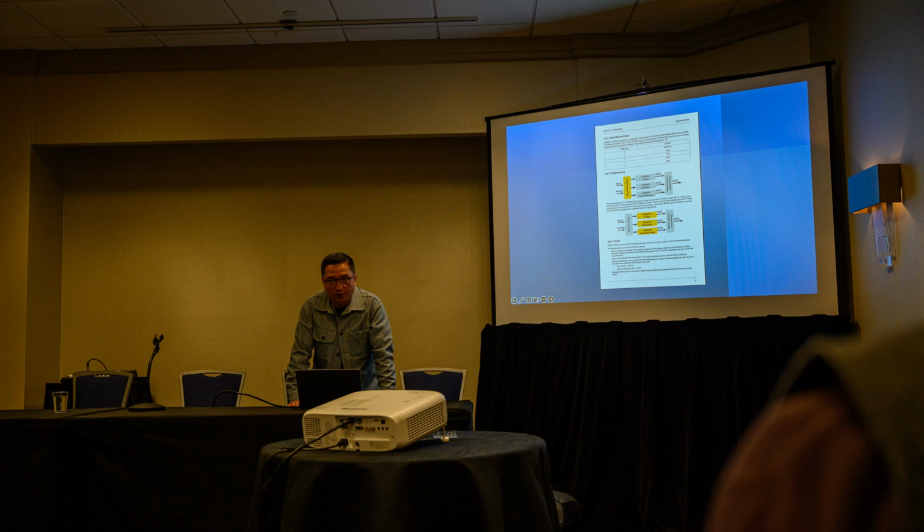I said I think there's time domain, binaural type stuff that we need to be aware of, right? Dan Foley, who's the acoustics guy who just retired from Audio Precision, also said I think time domain stuff is there. We just have to figure that one out. And when you think about the frequency response thing, if you think about what we're doing when we're measuring drum pressure as a function of frequency, right? That's what we're doing because we're simulating the eardrum. We're measuring drum pressure as a function of frequency.